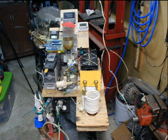Just to the left of the bright yellow baffle is the 12-volt DC cooling water pump. In front of the baffle, you see the 2 5/8-inch ID work coil. That's the size that usually comes with the 1800 and 2500-watt heaters.